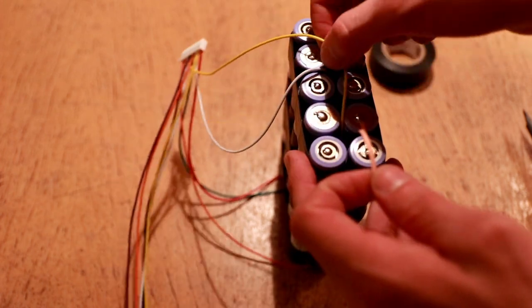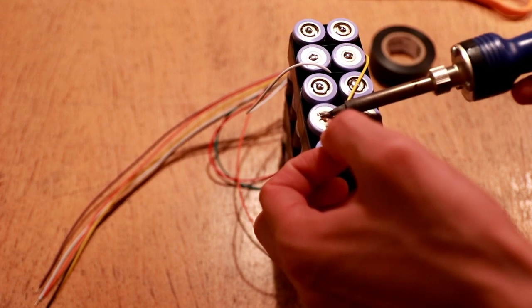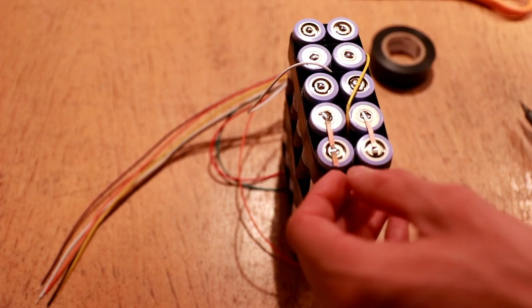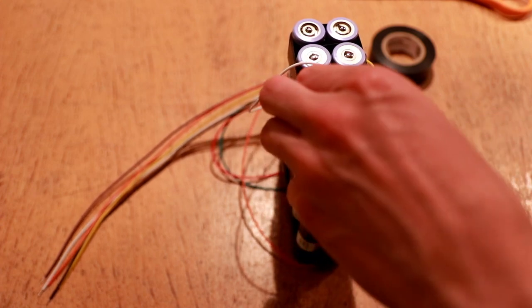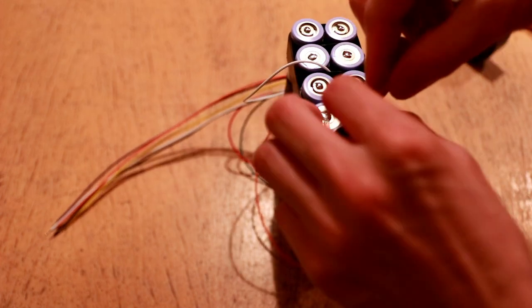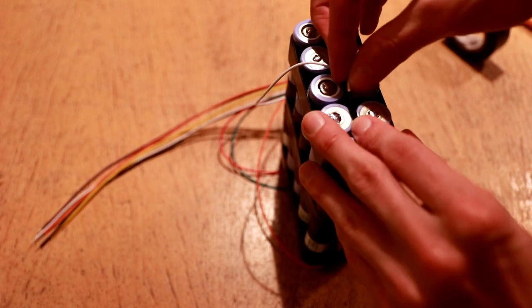I want to be careful not to accidentally burn or melt any of the balance leads, so I'll tuck those aside during soldering. I find it works best to preheat some solder on the actual cell cap — especially on these negative terminals — before feeding in the wick. That makes a much stronger bond and ensures the dwell time isn't too excessive. If you see a slightly dry joint, sometimes it's beneficial to flow a little bit of extra solder in. We did nick the wire just slightly with the iron but since there's no exposed copper I'll put a couple of layers of electrical tape around it to be safe.